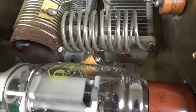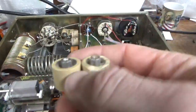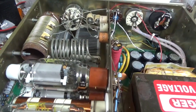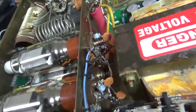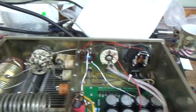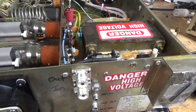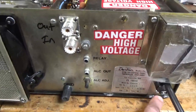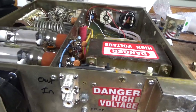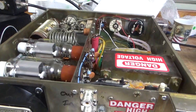Put a brand new plate blocking cap in — it had two in parallel, but one was really damaged, all chipped. Prone to arcing when that happens, so I put a brand new one in. Everything is nice and clean. This came out really nice. You can replace the panels — the top and bottom panels. At the bottom, over the years it got bent up a bit, but it's not a big deal — you could always find them on eBay. This thing is good to go.